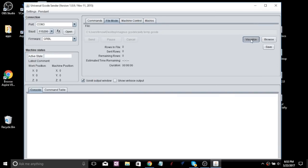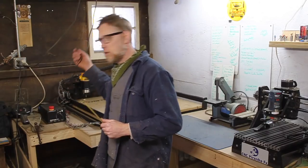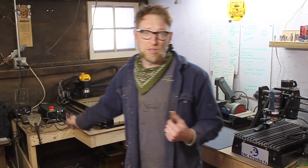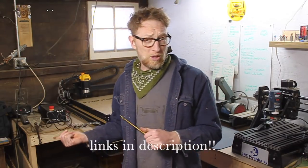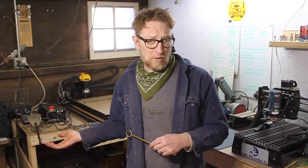It works really well. Sometimes I have some issues with it, like it stopping the run or something like that. I think that once I replaced the USB cable with the highest quality USB cable I could find, that helped a lot. So I think a lot of it was just hardware connections. And that's how you can run one of these machines in your shop if you don't have Wi-Fi. And you can also use your favorite software with it.